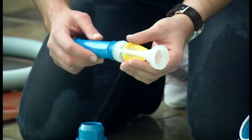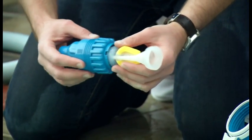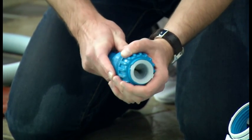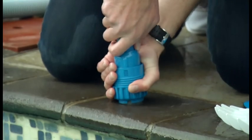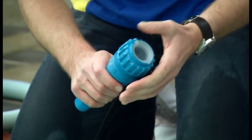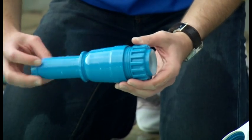To reinstall the diaphragm, first attach the diaphragm to the inner extension pipe. Insert the inner extension pipe with the diaphragm into the cup assembly. Align the diaphragm tabs with the notches and pull straight through until the top edge of the diaphragm is visible. Ensure the bottom of the diaphragm is flush with the bottom of the engine assembly.